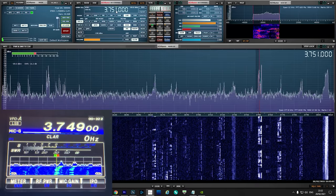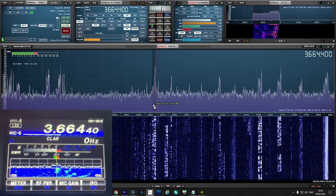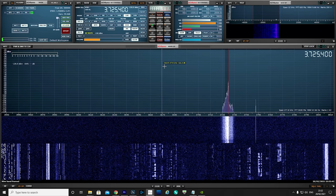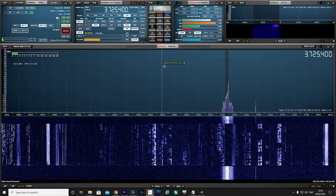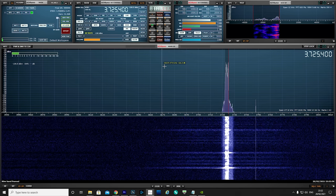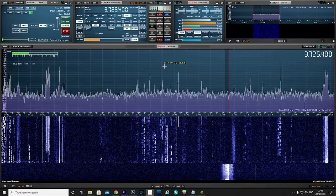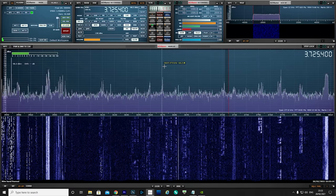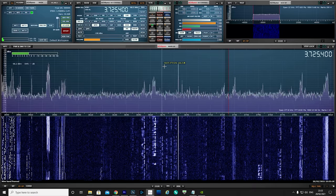As you can see, when I change the frequency on SDR Uno the frequency also changes on the radio. When I key the mic, SDR Uno goes into audio and RF mute, further protecting the RSPDX receiver from the strong RF coming from the radio while transmitting. The FT991A does have its own waterfall band scope on screen, but it only shows a small portion and isn't truly real-time — it's a bit jittery. By using this SDR switch I'm able to see the whole amateur band, see all activity on the 80 meter band, and at the click of a mouse I can tune to any frequency.